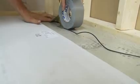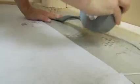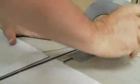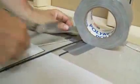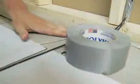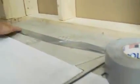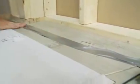Electrical wiring in the floor, other than that for the heating system, must be at least 2 inches away from the heating panels and/or separated from the heating panels by insulation or the building structure. Similarly, for heating sources such as hot water pipes, stoves, fireplaces, wood stoves, etc., at least 8 inches of clearance must be maintained.